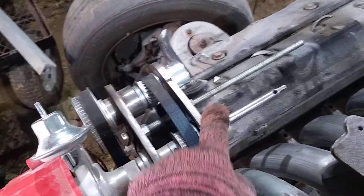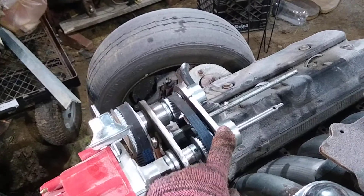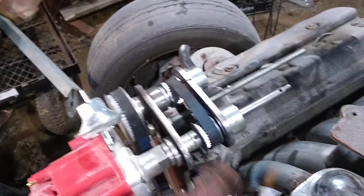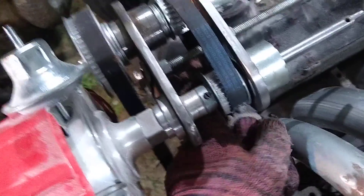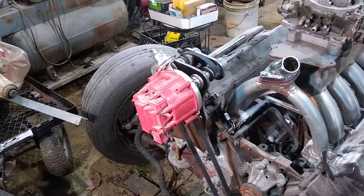My current project on this is to finish the rear brace and finalize how I'm going to do this center stud to hold the whole thing together, and I have to work out my tensioners. This belt needs a tensioner, and so does this one. I'm planning an arm off this bolt that comes down like so. When I have the final completed piece, I'm going to take it apart and do drawings of it for anyone interested in duplicating it. If you knew what you were getting from the very beginning and ordered it all at once, it'd probably be about 200 bucks — for belts, sprockets, the distributor, bearings, things like that.